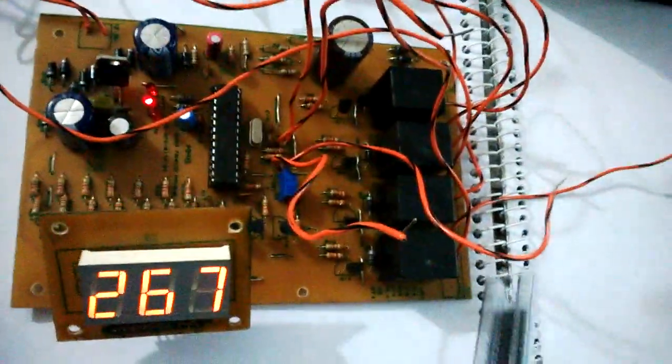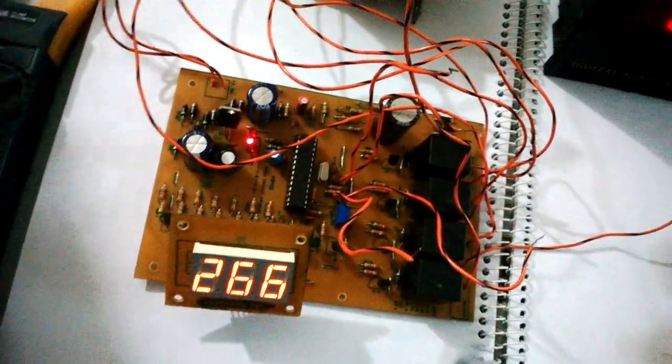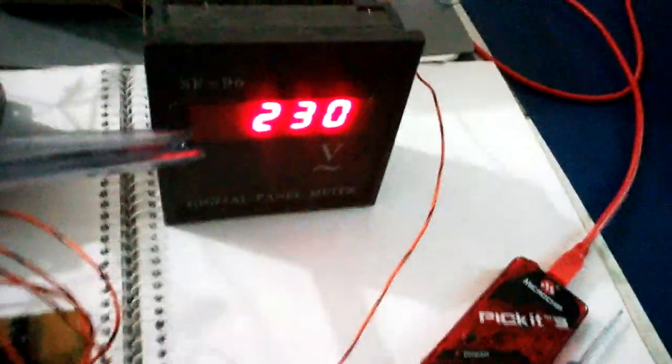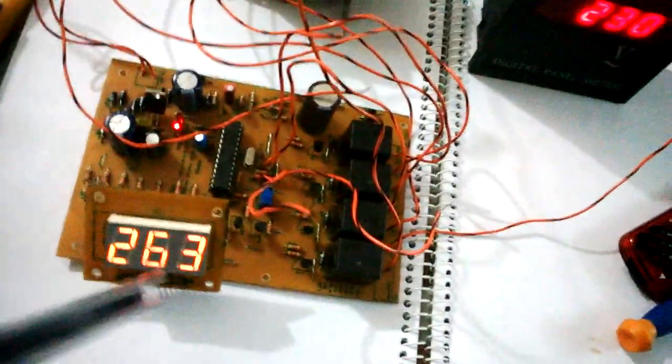The relays work sufficiently well all the way from below 120 volts to above 270 volts input. Each relay has an accompanying freewheel diode to capture the inductive kickback and make sure it does not destroy the transistors. This is the auto transformer with those five tappings — the relay selects the input and output voltage tappings and maintains the output well within acceptable limits across a large input voltage range.